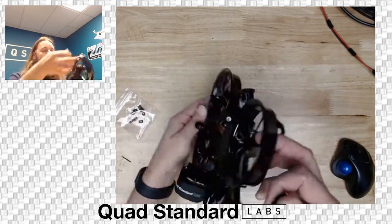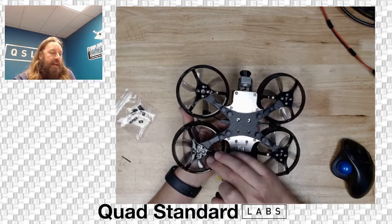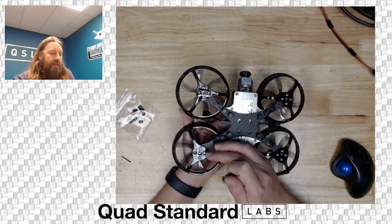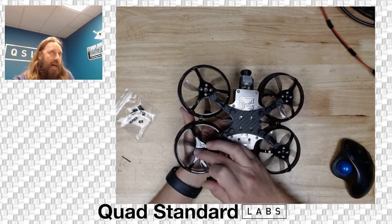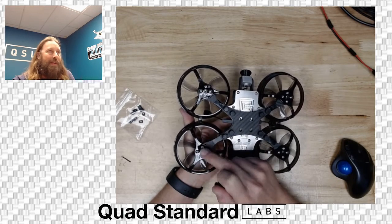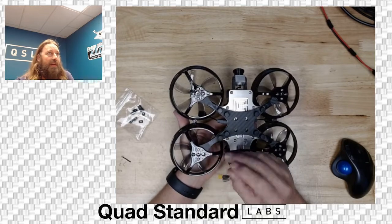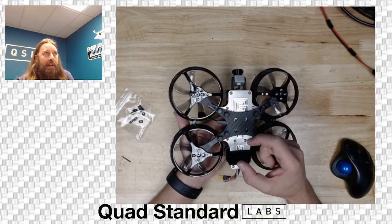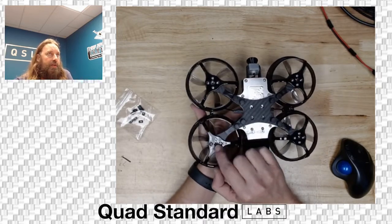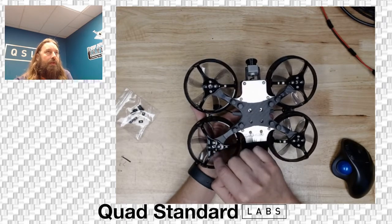We insert all four motor screws and we do them loosely, and then we tighten them in rotation like you would a spare tire if you're changing. So tighten it kind of tight, kind of tight, kind of tight, then all the way tight, all the way tight, all the way tight. Check the last one, do a quick check. Once we have those four screws in there, that really gets the motor as center located as you possibly can on the arm. You then want to pull out the two screws that you're not going to be using that are motor screws. So the north and south.